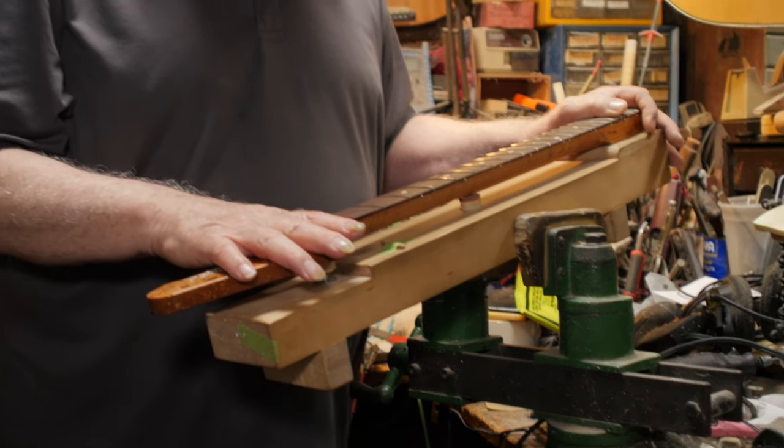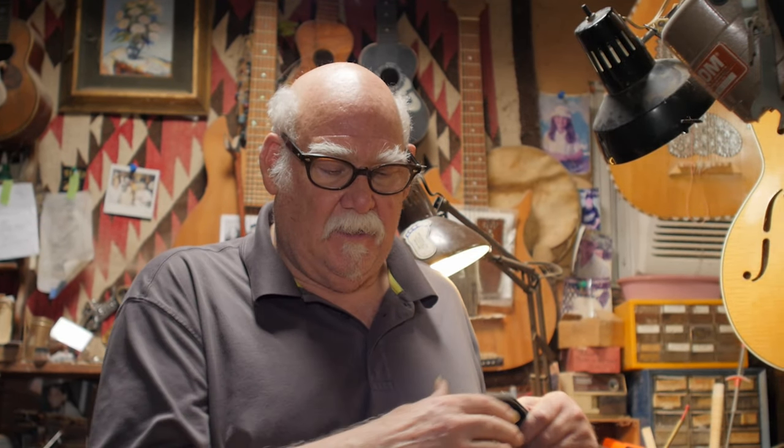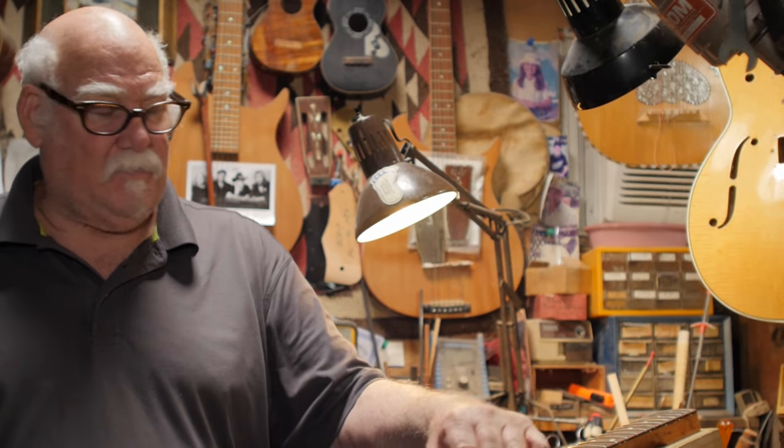Okay, and action. All right, that's pretty much the end of the fret cleaning up on the ends of the frets, the dressing of just the ends of the frets after the initial fret job has been done. At this point, I'll take this jig and start sighting the neck and make sure the edges are nice and straight. This neck is sitting in this jig perfectly straight. It's been leveled with a notched straight edge and a straight edge. The frets are put in very, very evenly, so it will take next to no dressing over the tops of these frets. But that'll be the next step that we do on this fret dress.